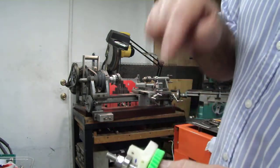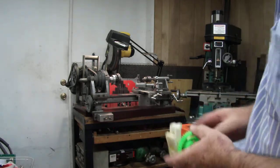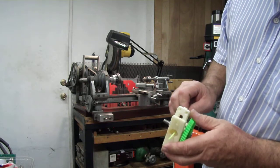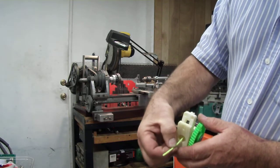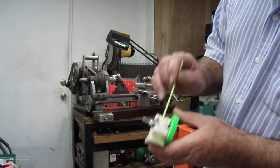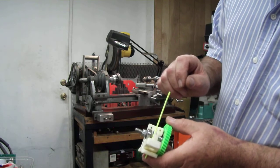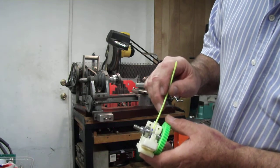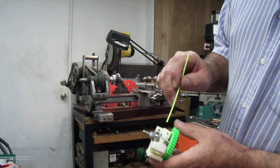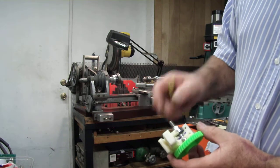What I've done is identified where the filament feeds through into the extruder — it goes through this hole right here. This hob bolt actually turns and pushes the filament through into the extruder so it melts. So we want to make this serration in the bolt right there where the filament lines up with it. What I've done is taken a marker and marked all the way around the bolt where I want that serration to be. Now let me unbolt this and we'll take it over to the lathe to make the serration.